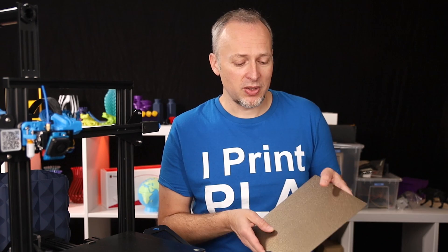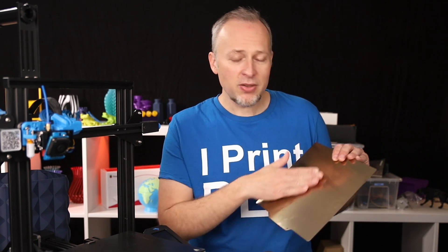It's from Energetic — I'm putting a link in the description. I've put this on all of my printers except the V2, which I'm going to do right now to show how easy it is. This is the best solution I could find because it has a flat surface but also a rough side which is even stickier and works for basically every material. And the good thing is, once it cools down, you basically don't have to use any force to get things off — whereas with a glass plate you have to wait for it to cool down, which slows down rapid prints.